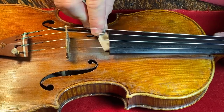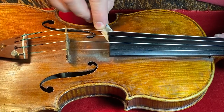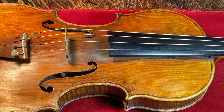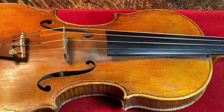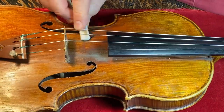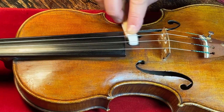And in this one case, when I compared the footage, this really was the better view. And I did speed up a lot of the footage so it wouldn't take half an hour. My advice is to keep moving on the instrument. Keep moving to a fresh place on the cotton. And keep watching diligently for the slight color of varnish, which will sometimes come all at once.